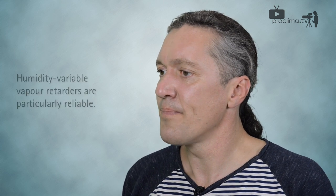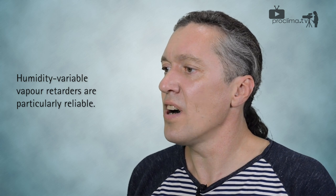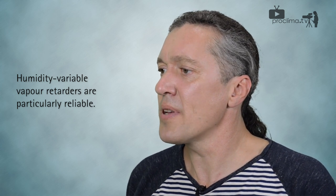Michael, thanks for being here. What's HydroSafe? In simple terms, it tells you how safe a building element is during the construction phase. Humidity-variable vapor checks can have different resistances to the diffusion of moisture vapor — that's how they protect the building elements. It is important that the spread between humidity-variable vapor resistances should be as large as possible. A vapor check can only offer maximum protection if it is as impermeable as possible in winter, meaning that little moisture vapor can enter into elements. On the other hand, it should be very open to diffusion in summer to allow elements to dry out again when necessary.